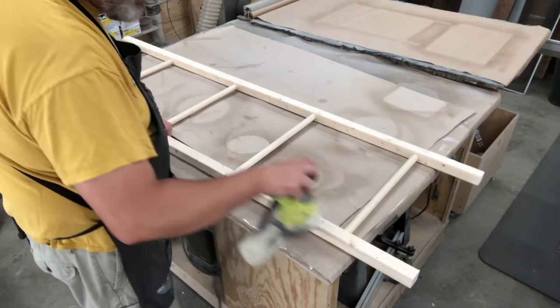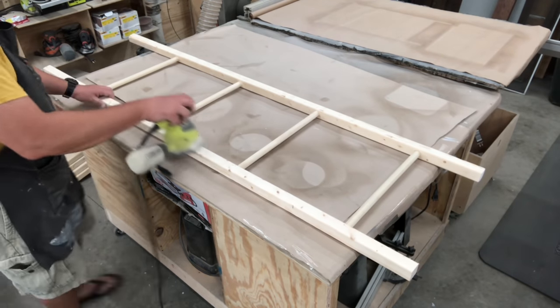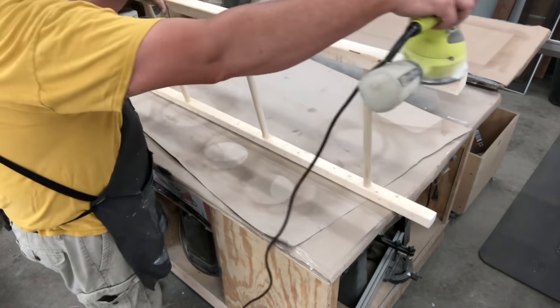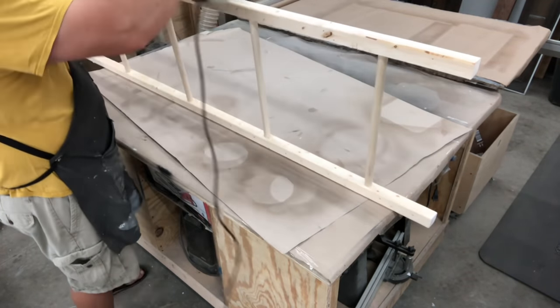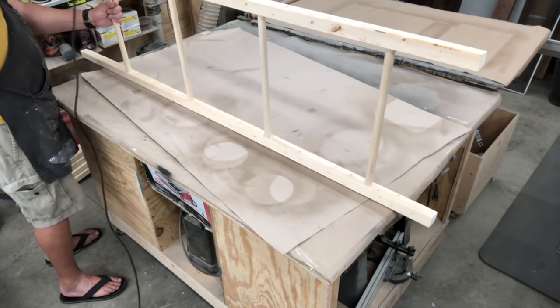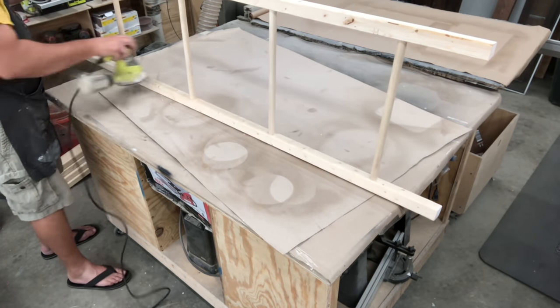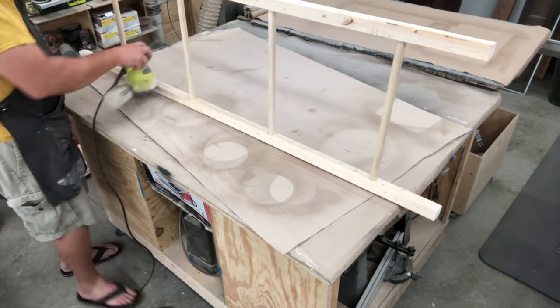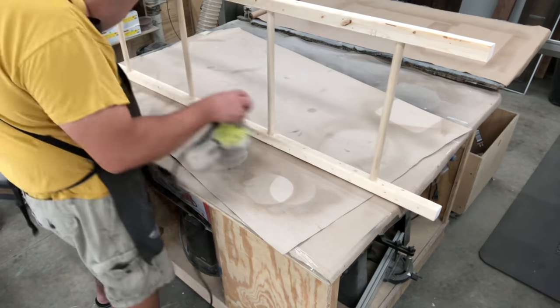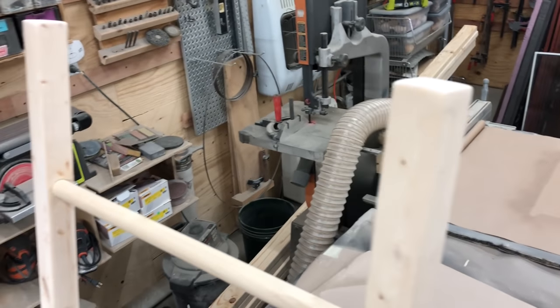And then a quick overall sanding, because when it comes to the dowel rod ones, we stain it and paint it the same color. Sometimes when you have that raw, really rough wood, the paint doesn't take and look the same. These one-bys are always a little on the rough side, so just give them a nice sanding. Even if there's chips or gouges, still sand it so it's smooth and doesn't hurt anyone's hands when they touch it. Sanding just gives it that nice finished look, especially when he sands the tops like he does.